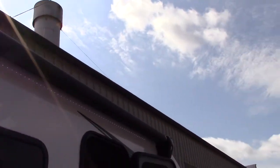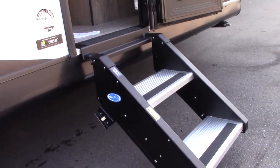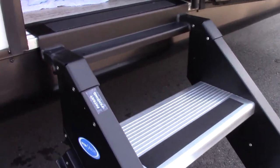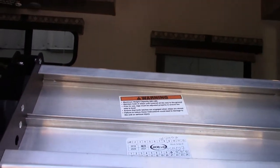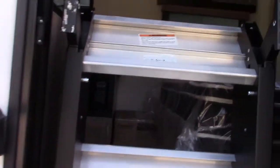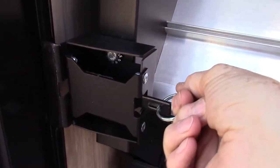You have a power awning with an LED light strip and outside speakers. Your stairs fold right up into the trailer. On this particular one, after you fold it up, you have to pull the pins and extend your legs. First you have to put these vertical, then pull this pin right here, and raise the legs up a little higher so the stairs fit in properly. It has a latch right here to release it.